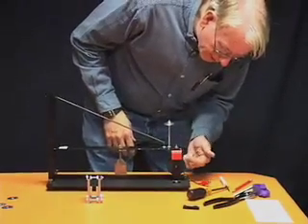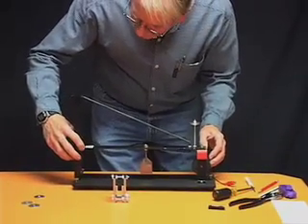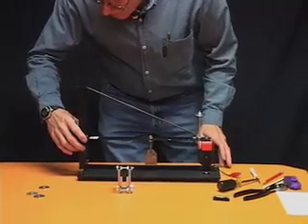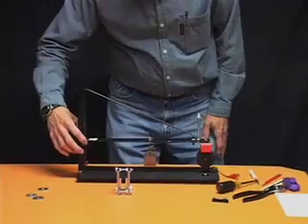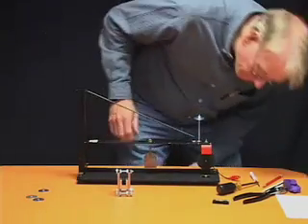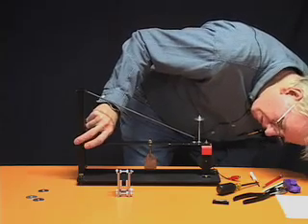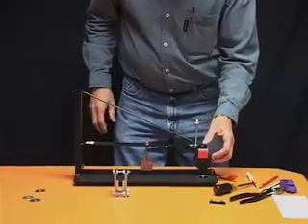In my case, I'm a little bit tight on my side, so I'm going to make the final adjustment just by sliding the knife edge slightly in this groove. For the final adjustment, about a millimeter of motion, you can do that by sliding the knife edge. And it's pretty even now, so I'm not getting any scraping.